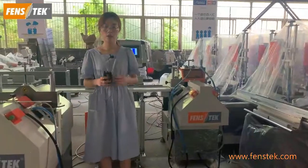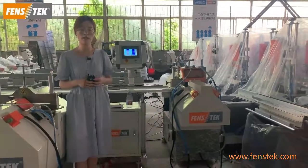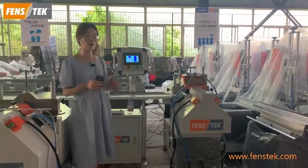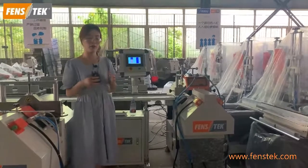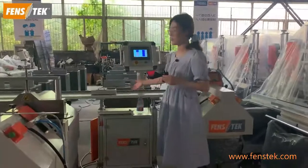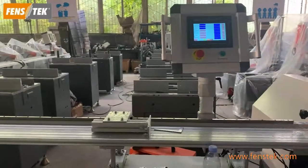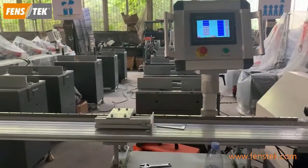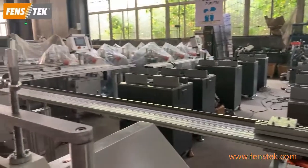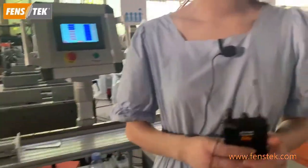The second machine we would like to introduce is the mullion cutting machine. This mullion cutting machine is used for cutting the mullion profile when making UPVC windows. In order to ensure easy operation, we also install a CNC stopper on the machine, so it can realize automatic moving and the stopper can achieve precise automatic positioning. Now we show how this machine is working — let us ask our engineer to demo the machine.